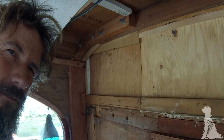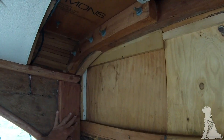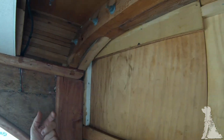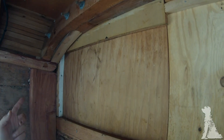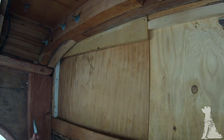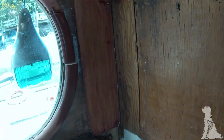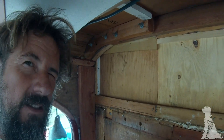I'm going to take this corner piece out. I have to point the camera into the dark corner because as soon as you see the brightness outside you'll never see anything in here. This piece has to come out - it's screwed from the back side underneath another piece of wood that's screwed to the outside with plugs, so there's no way I can get to the screws. I'm going to split it into pieces with a chisel, leaving the screw heads exposed, then grind them off with my grinder and put a new piece on, screwing and plugging it from this side.